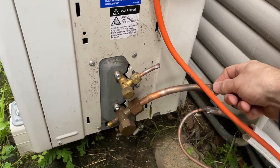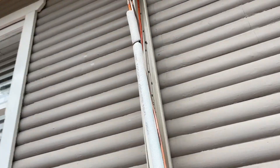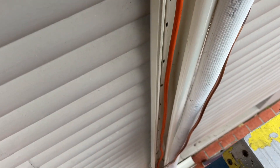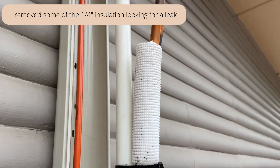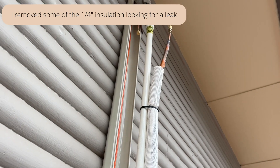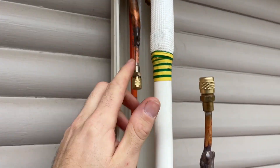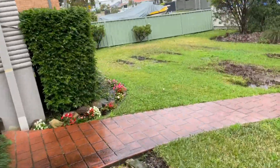Basically you just cap that shut and that shut, pressure tested just the outdoor unit, and I'll show you what it looks like on the other side of the house. That's the other side of the line set. I've pressure tested just the pipe itself and just the indoor unit itself. I've put my gauges on — both the indoor unit and line set have got high pressure, so they're good. However, the outdoor unit has dropped pressure. So I'm going to take that apart and do a pressure test on just the outdoor unit.